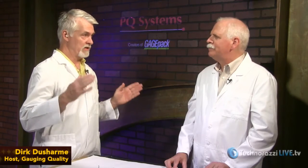He documented it, ran it by his processes, made sure it was valid, and he showed, if you take what tolerance the manufacturer would allow at that, they don't specify it there, but use their numbers. Say it's percentage of reading. It's got to be accurate within 0.025% of the reading, whatever. If you apply it to those numbers, you'll get a tolerance. Not the manufacturer's tolerance, this is the one for your special use. He was showing like a quarter of the tolerance was used, over and over, repeated within 1 digit. So what he basically did is validate that this instrument would work within the range that he needed, and he checked it every which way using traceable weights and a written procedure.